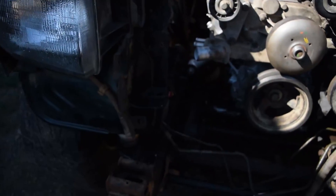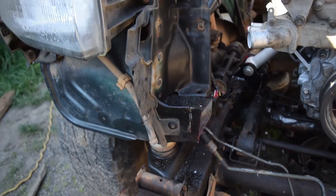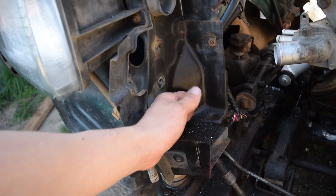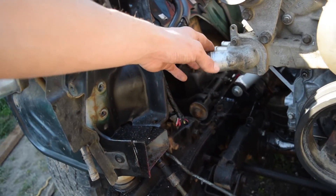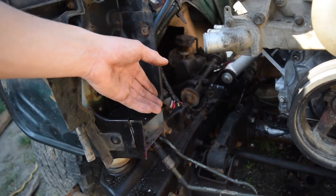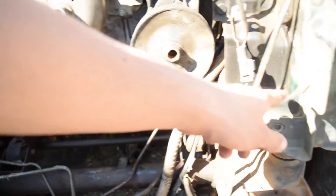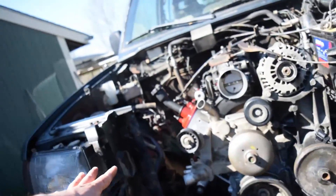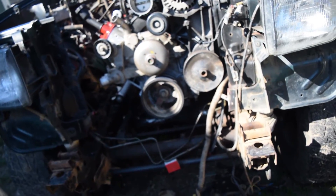What we need to do here is chop this right here and kind of follow it up. There's going to be probably like a six inch radiator hose here. We're going to chop that side, chop that side, and it should sit right here in between the frame rails. This is about 28 inches long, and we have about 31 inches in between these supports here, and it should fit pretty nice.